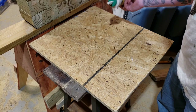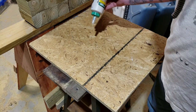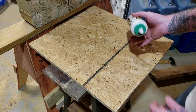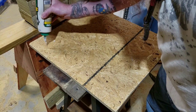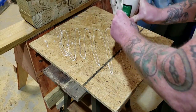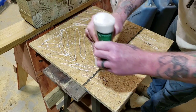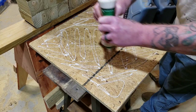I'm going to do a piece of plywood for the back side. The front side I'm going to sand. I'm going to coat it and lay my project on there, then cut all my boards to fit. I'll set this on the floor, let it cure, add some weights to hold it down. You apply the glue sort of like putting mustard on a hot dog — just coat it all around. Everything's pressure treated and ready for the elements out here — it gets 100 degrees and 90% humidity.